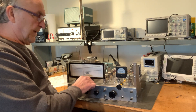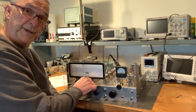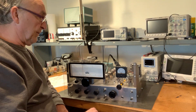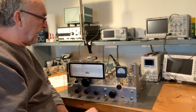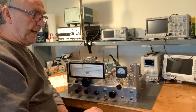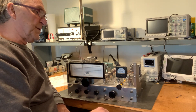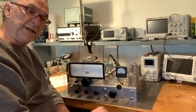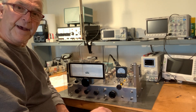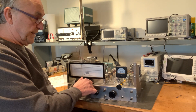That really has been my goal ever since I was a novice in 1967 — to build my own station. Not marginal, but an actually good station that I would enjoy using on the air. And this HBR-13 really does a nice job. I wish it had more filtering. My plan is, since I have all this gain, to put some passive audio filters in for CW and sideband — especially CW — to narrow that up. I wouldn't mind getting around 800 Hz bandwidth. That would be very nice.